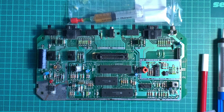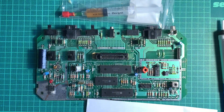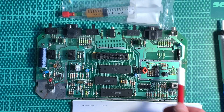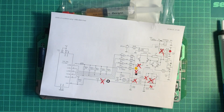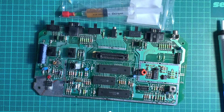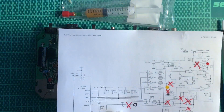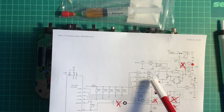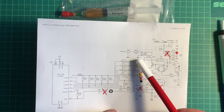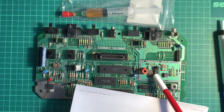What components do we need to remove for the mod? First I'll add some flux, and I'll also turn on the soldering iron and get the solder pump ready. These are the schematics for the Junior — for this particular kind of Junior without the RF box and the discrete components. Over here we have the TIA, and this component right here is the video adapter or video chip. It goes through several resistors and some op-amps, some ICs, and some more resistors. And this is the RF stage with the LM3086, which is a couple of transistors on a chip.